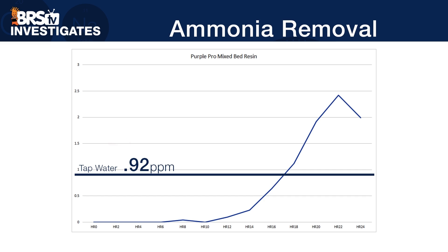The same is true for cation resin, where one of the weakest bonds and first contaminants to be purged is ammonium — a form of ammonia with a weak positive charge that the resin can remove. Our water had 0.9 parts per million ammonia, presumably from chloramine. Initially the cation resin removes it all or near all, but once depleted it doesn't just go back to 0.9 — it nearly triples to 2.4 parts per million during the purge, then starts to fall off for the next weakest contaminant.